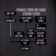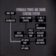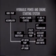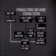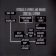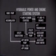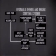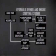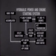To start the main engines, the same procedure is used to obtain utility system pressure. This pressure is then diverted to the hydraulic engine starters, which start the main engines. The engines now provide hydraulic and electrical power by driving the aft transmission and accessory gearbox.